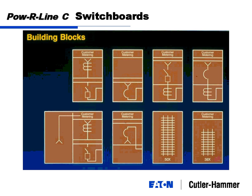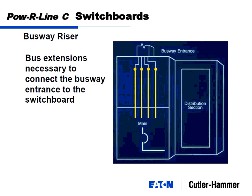And then really the switchboard is just putting all the pieces together. We talked about cable. We didn't necessarily talk about bus duct yet. I don't know if you've gotten into bus duct. Next project. Okay. Just to make sure you're aware of it, there's an alternative to cable called busway. Busway is, say, 1/4 by 6 inch copper bus bars, just like what you'd see for horizontal bus in a switchboard. And we can take your vertical bus on the switchboard here, put this together, and take out of the top in busway. In this case, it's a main device.